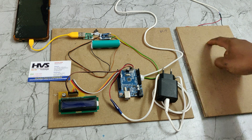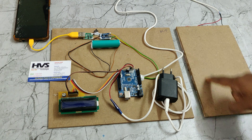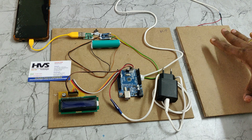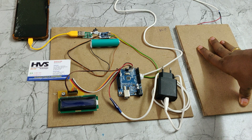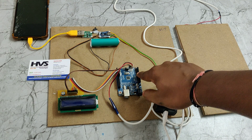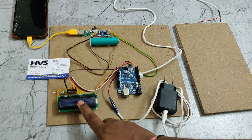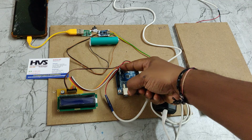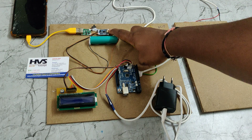The nine piezo plates are arranged in a three-by-three configuration: three in parallel and three in series, so a maximum of six to seven volts can be generated from the piezo plate section. That voltage is continuously monitored from the A0 pin of the Arduino board and displayed on the LCD screen, which is interfaced at pin numbers two to seven. We are using the TP4056 battery charging circuit.